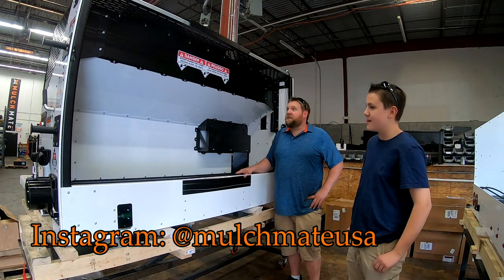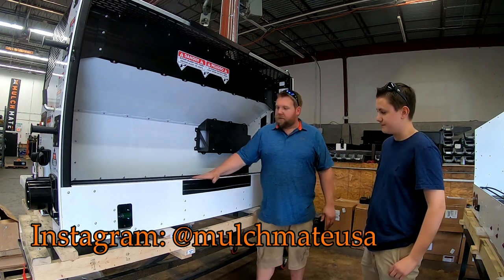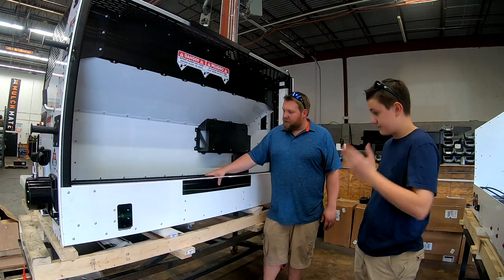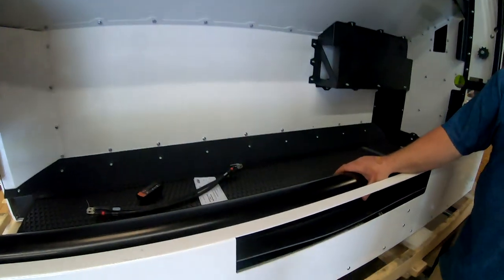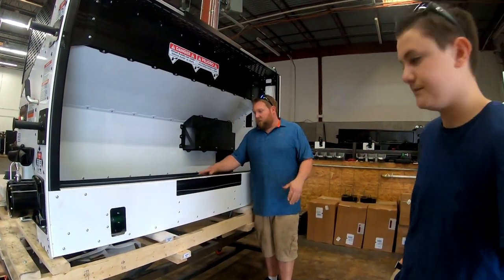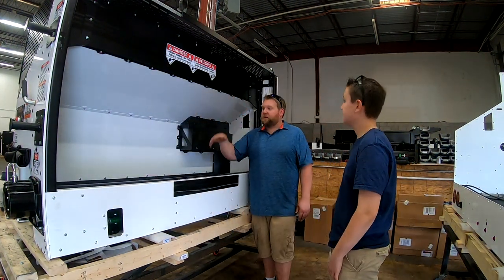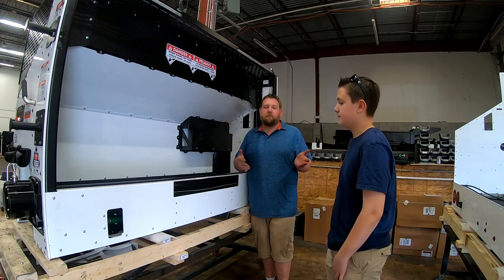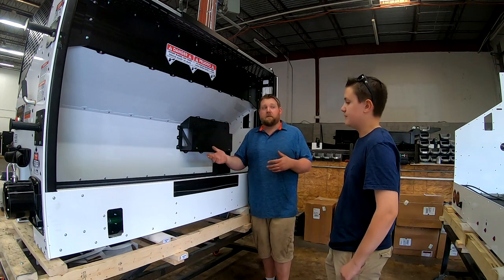So this is the business end of Mulch Mate. This is where the mulch would enter here. This top plane here is going to be the floor of your truck. You would pull your tarp out and make it wrap around this pipe here — it actually gets Velcroed on right there. When you get the tarp pulled all the way out and you put your material on it, this is where it's going to roll up around this pipe. And then you're going to have two augers that are typically here. That's what fluffs the material and gets you more yield. For every 10 yards you put down, those augers are going to give you an extra two yards. So that's a really nice feature.